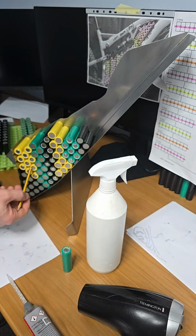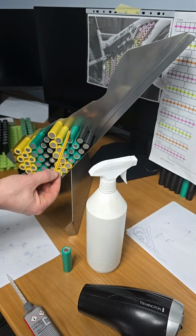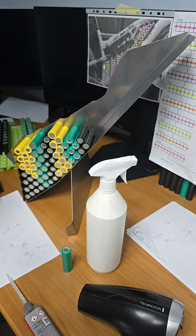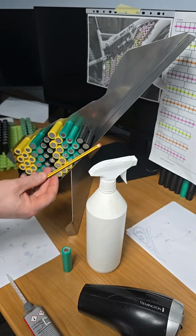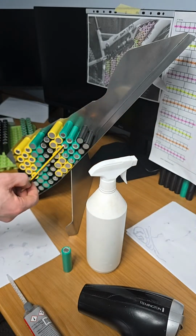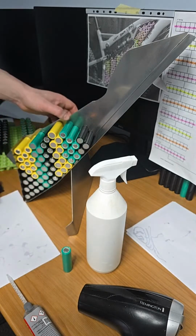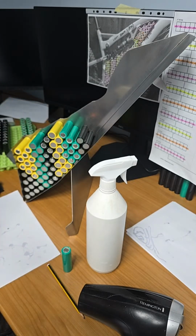So string number 1, 2, 3, 4 and 5 is complete. We're now going to work on string number 6. Is it? Yeah, 6. So green corresponds to orange, remember that? So what I can do here is just place the cell in with positive pole facing out, because remember, in the plan, string 6 and 7 is connected to each other. 1, 2, 3 at this side. 4, 5. So you imagine a copper plate around here. So these cells need to be in the right position. I'm not going to talk about connections yet.